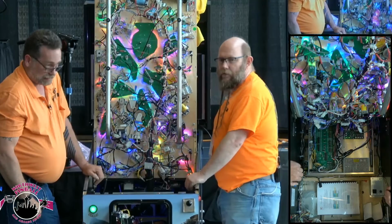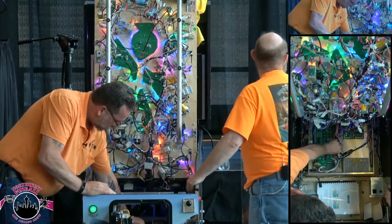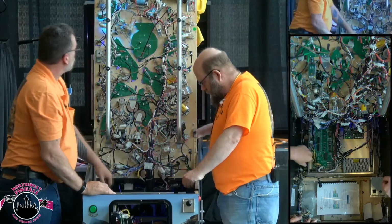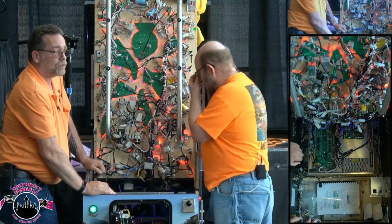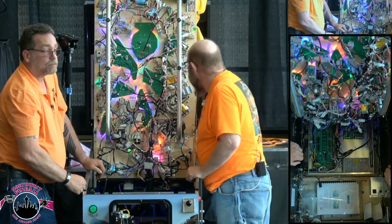The other lighting system issue is this particular cable right here. It's kind of hard to see, next to the really fast flashing light. That one you always want to check to make sure no wires come out of it, because that is the very first cable that goes into, I believe it's WAS 29. Excuse me, WAS 6. It goes into the very first board, and if it doesn't feed the first board, then you get nothing in 2, 3, 4, 5, 6, 7, 8, 9, all the way through the rest. That one at both ends has a tendency to have one of the wires come out. And it's not that hard to fix. You just have to be able to identify it.